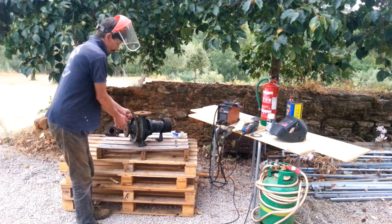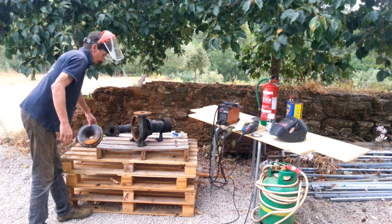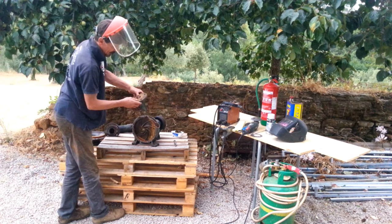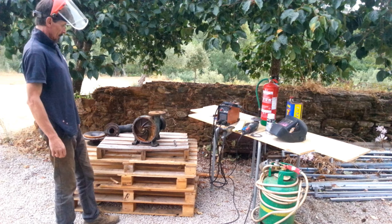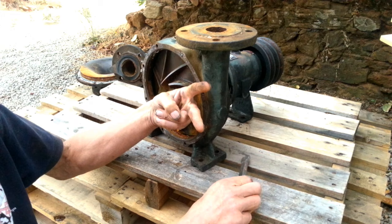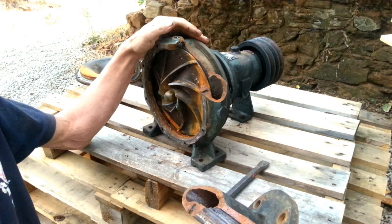What I'm going to do today is remove this front section. I've already partly removed some of the bolts. The thing's extremely heavy. I've got the impeller blade in here, which runs very close to the crack. I've got a lot of preparation and cleaning up to do before I can get on with it. There's the crack. What I've got to do is open it up into a V, so I fill the V up with weld. Because you can't just weld this along here like you can with mild steel - it will just break.